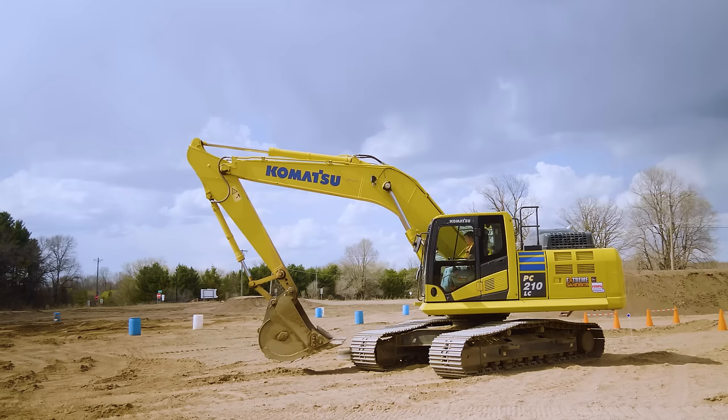So now with that said, to dig, I extend this all the way out and go stick out. I'm just going to show you how to do these really basic, as we do with brand new clients on our site. I always recommend stick all the way out for a brand new operator. This is not how an expert is going to operate. You're usually going to have the stick maybe 45 in, but to me, distance is your friend in the beginning. So I like to start all the way out. I come down then, I'm about a foot off the ground.